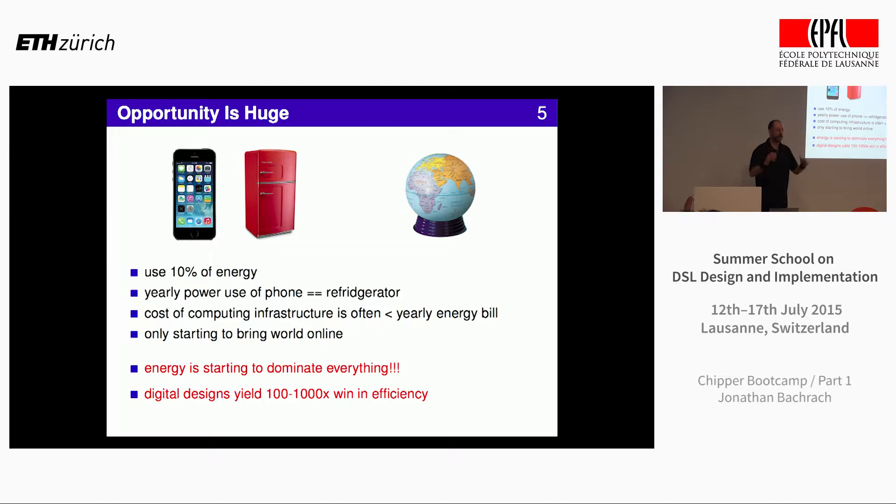It really takes a lot of thought and careful design to get computing systems that compute more efficiently in power. We have so many transistors and they're starting to leak — we can only run them as fast as we can until they melt. If we could run them faster, the problem is the chips will melt. So the only way to go faster is to make them more energy efficient. That's what we're trying to do.